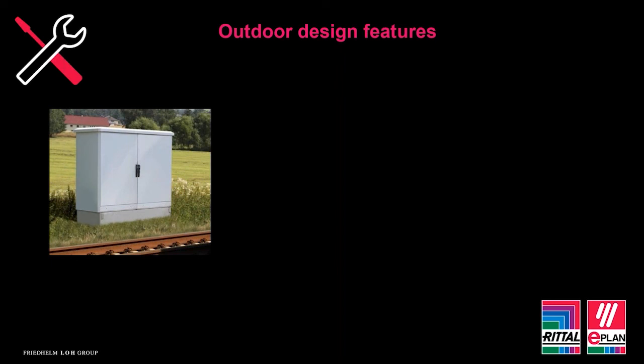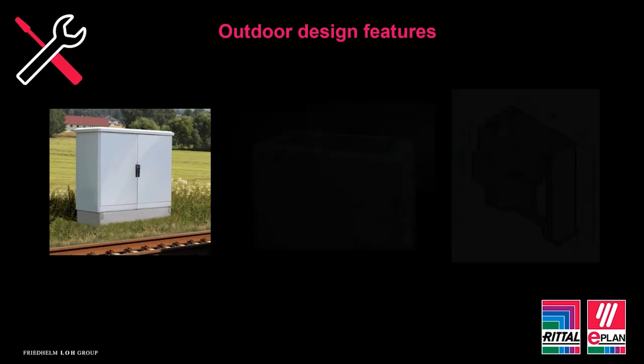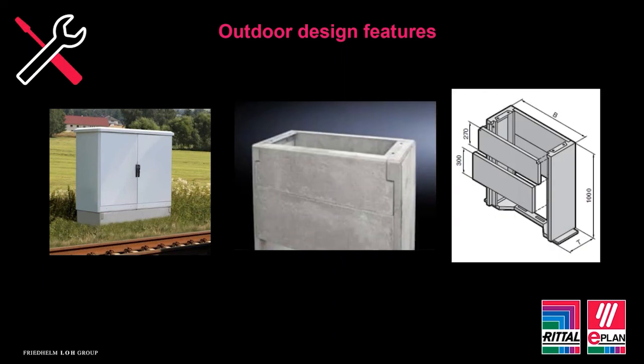Now, when you're placing a cabinet outdoors, you also have to consider how you're going to attach it to the ground. Sometimes you might be replacing an existing system and a plinth is available that the enclosure can be screwed down to. In a new project, simply screwing it to the floor probably isn't an option. Now, the above plinth system is a great solution. It can also be removed, so it isn't a permanent structure.